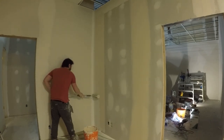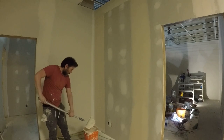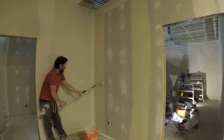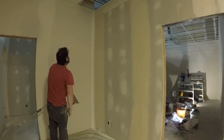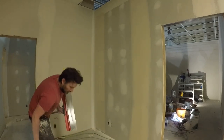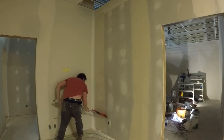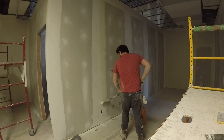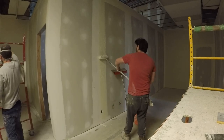Even the 12-foot stand-ups and a 10-foot top on the big demising wall — I was able to tape 12 feet up using the extension poles. They have extension poles for everything. Speed-wise I don't have a lot of experience to compare against boxes, but it goes pretty quick. You literally just bring a bucket of mud, roll it on, swipe it off — I think it's an efficient system.